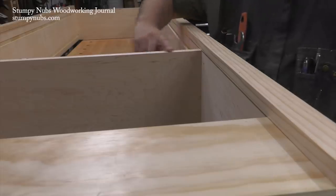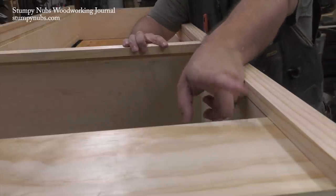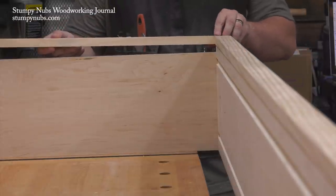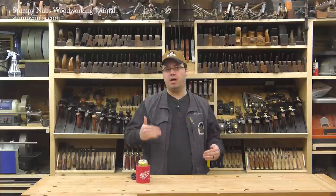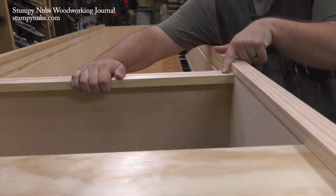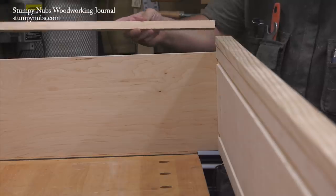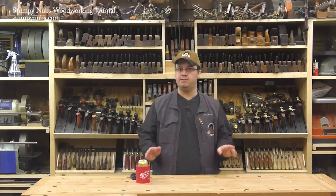Here I made a mistake. When I tried to put the pine edging on the fixed shelf in the center of my bookcase I noticed it came out flush with the edging on the sides when I wanted it set back three-quarters of an inch like the kick plate. And when I tried to put edging on the top shelf it was set back too far to come out flush with the sides. I seem to have mixed those two shelf panels up — one was deeper than the other and now they're glued into place. To fix it I glued the pine edging on the underside of the center fixed shelf instead of its front edge. That leaves the plywood layers exposed but I'll use edge banding to cover that up later. On the top shelf I glued a spacer to the front edge to make that shelf the full depth it was supposed to be. This is a great example of how everyone makes mistakes, and if you don't panic you'll likely find a way to fix it — and as long as you don't go around pointing it out, no one's gonna know but you.